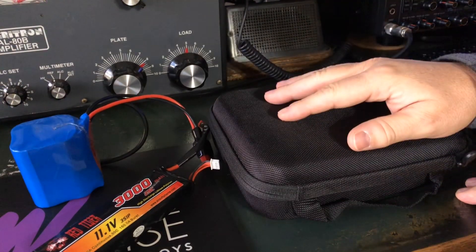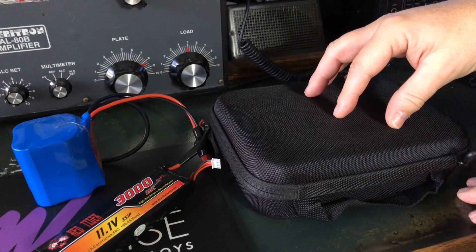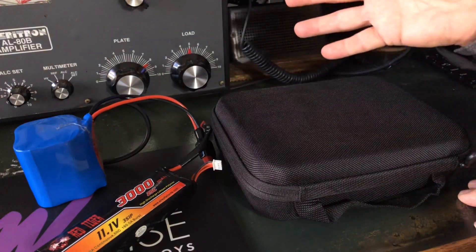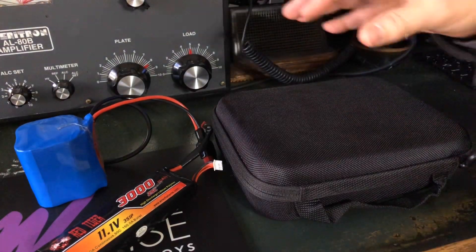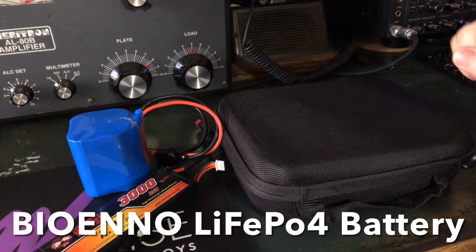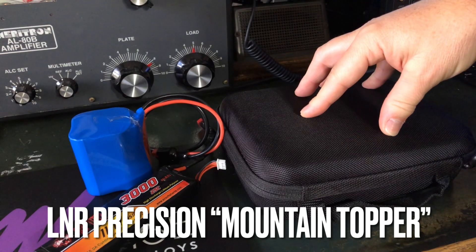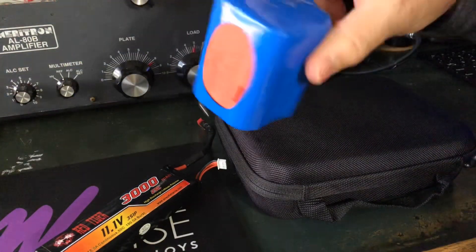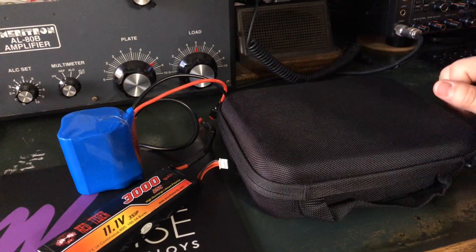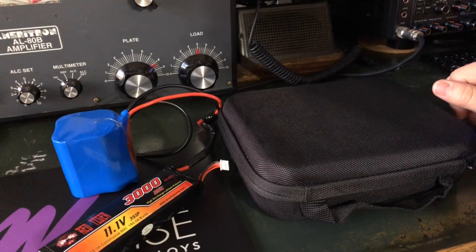If you're not into that, you may not be interested in this video. But this involves the little QRP radios that are CW only, that many of the SOTA and some POTA operators will use, and just QRP enthusiasts in general. The question is: how do you use a BioEnno battery with one of these rigs? Because if you look at LNR Precision's website, the specs on their radios say you are not to exceed 13 volts DC. And these BioEnno LiFePO4 batteries will charge up to well over 13 volts — about 13 and a half. So you've got to be careful about using one of these with an LNR Precision Mountaintopper radio.